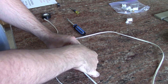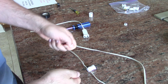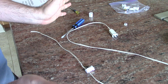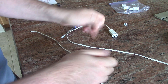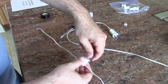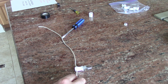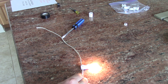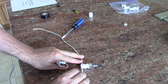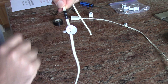Now you can check how everything is. One way is to use a multimeter — put one lead on the corresponding terminal and one on the correct prong. My multimeter prongs aren't the best, so I'll do this a different way. I'll put the light bulb back in the socket, carefully move things around, and see what happens. Excellent — the light came on! So we know the socket is secure and everything's correct so far.